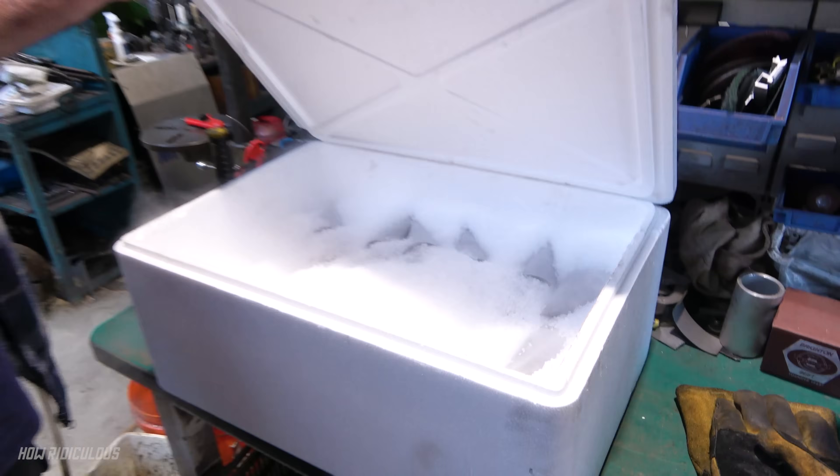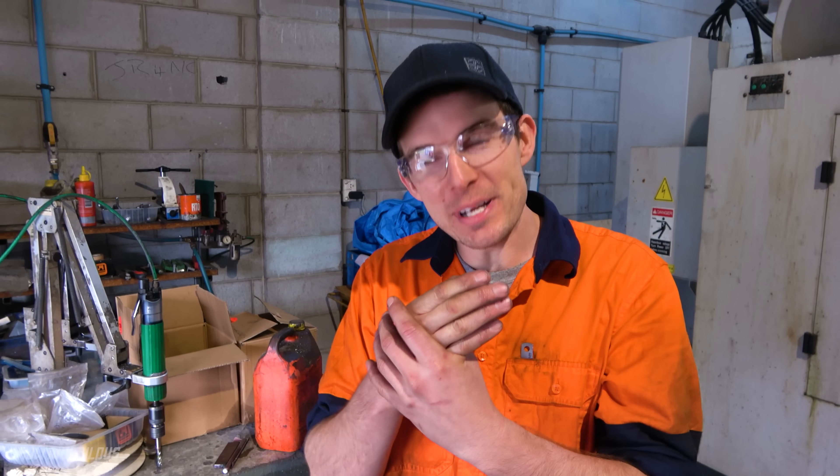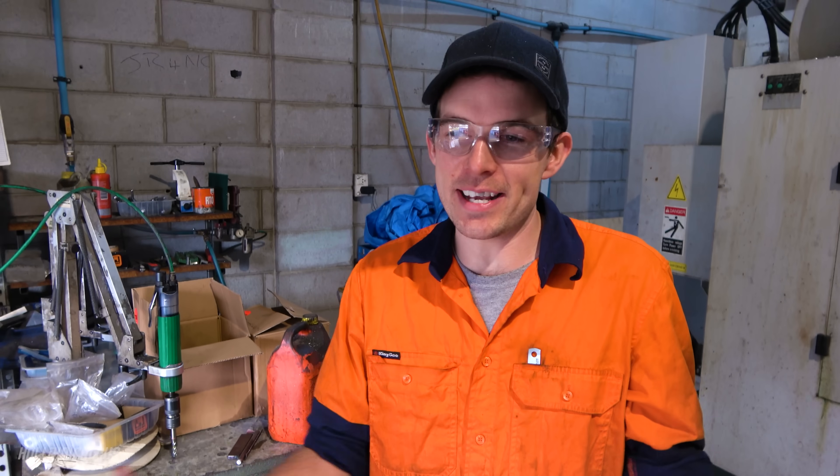What have we got over here? These are the babies — oh, the cold strike! You may be wondering why they're being cooled. I don't want to explain it because I don't know enough. If we cool them down they get smaller, we heat the ball up, the ball gets bigger, we put them in together nice and easy, and then when they become the same temperature they're super super tight. They're not glued, they're not welded — they're just stuck in there by force.